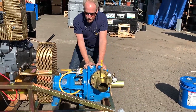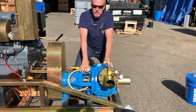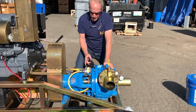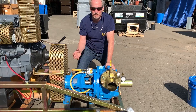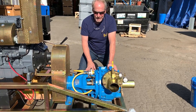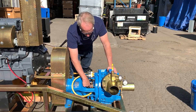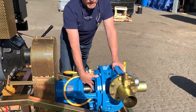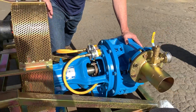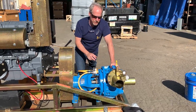A couple of things we do a little differently on the pumps is we actually use a grease injection system. On the shaft there's a grease injection system that is used for packing. You have to repack these at least once a day. You have a spring-loaded grease system that always pumps a nice, even-flow grease into your packing. If you allow your packing to get real sloppy, you can suck air or blow water out. Probably the biggest maintenance on this whole machine is keeping the grease system in check. You also have some bolts here that you have to periodically tighten up — one on each side — and that adjusts your packing. That's a very important aspect of the machine; it has to be maintained properly.